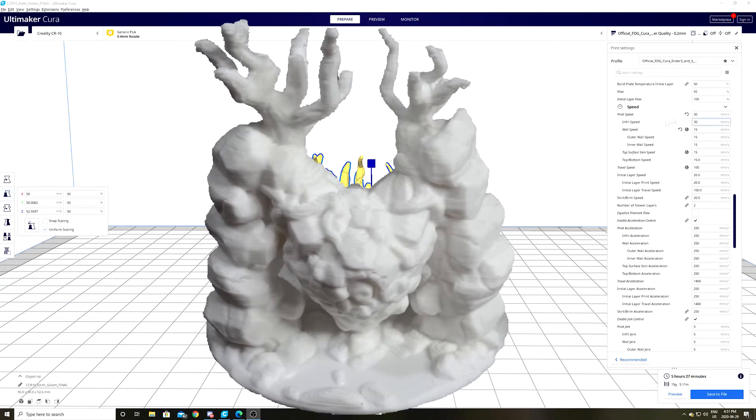So generally, when I'm printing with my Creality CR-10, I'm usually printing at under 60 millimeters a second. 30 is my comfort zone, but I wanted to find out what I was able to get away with and still have it be worthy for the tabletop experience. The first print speed I tested was 30 millimeters a second, at 0.2 layer height. This thing turned out pretty good — the model printed in five and a half hours. Pretty standard, can't complain.